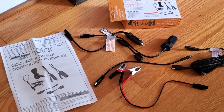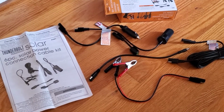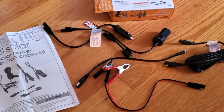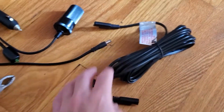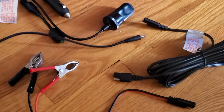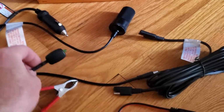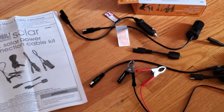I would tell you to reference gauge usage charts so that you know what size cabling you need. I wouldn't necessarily count on these if you have a heavier duty system. You don't want to overload one little connector or piece of wire and start a fire. But that is all based on watts, volts, amps, and the length of the cable runs that you are using.